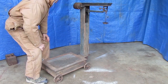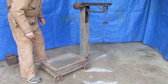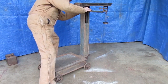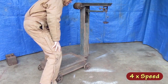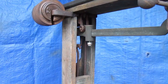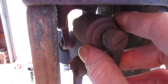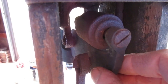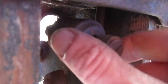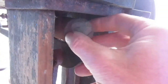Make sure the platform is floating inside the frame and the movable weight is all the way to the left. The beam is hanging low, so I'm going to zero it out with the zeroing weight. I can get it to zero out, but the zeroing weight is all the way to the end of its travel — that's because I removed some dirt and rust from the platform, sanded the boards, and removed screws. Now I need to compensate for that weight.